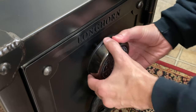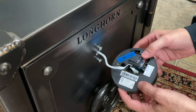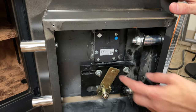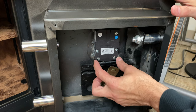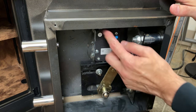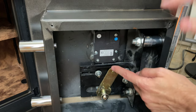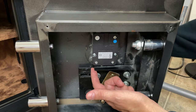These entry pads are usually just held in place by sliding over a couple of bolts in the door. These locks all occupy what is referred to as the same footprint — they tend to all be the same dimensions and are all mounted in the same way in the same locations. In this particular device, the swing bolt is facing downward, and that's what stops the bolt work here from moving.